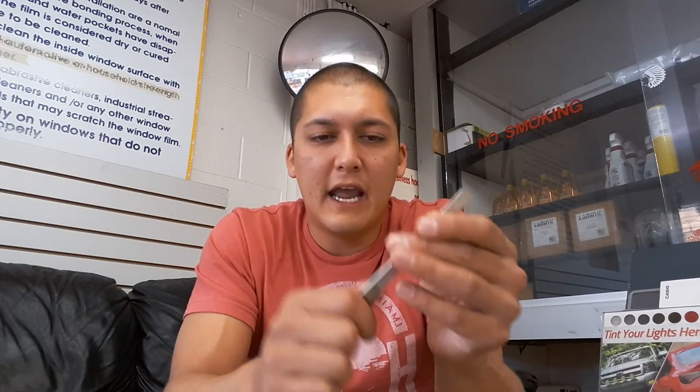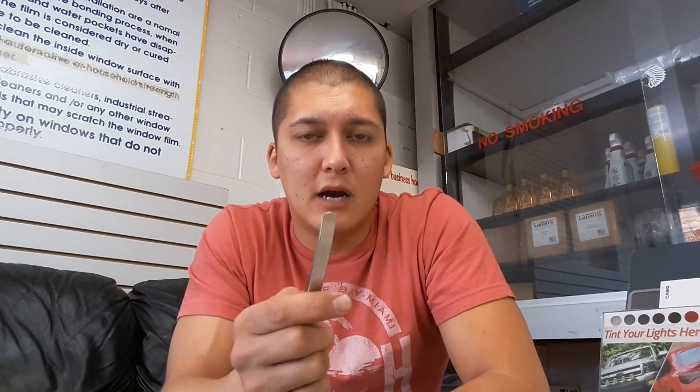Also in this knife I have Alpha blades — a stainless steel Alpha blade, nine millimeter, comes with 13 breakaway blades. This is what you want. If you buy this knife online, it comes with blades already in it — throw them away, do not use them, they're junk and poor quality. The knife itself is unbelievable and I love it. For the blades, make sure you get stainless steel — they come in a yellow box. Alpha also makes a carbon steel blade in a black box — do not get those. Carbon blades are too sharp and too tough for glass; you will mar it if you don't know what you're doing. The last thing you want is to scratch glass you're going to have to replace and end up owing money instead of getting paid.